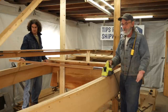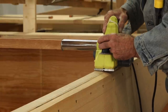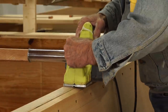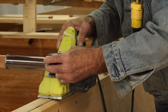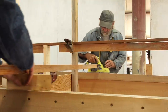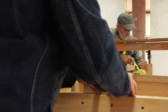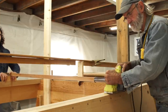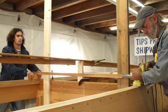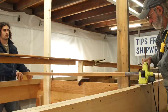I used to do all this by hand and it was wonderful, I enjoyed it, but we've got power now. So when you've got power, you use it. This really does make it easy and obviously much, much faster than if I was going to do it with hand planes. I could make a depth mistake if I had the plane set way too deep, but I can't make an angle mistake because it's being controlled from the other side of the boat. Caleb is working up and down with me as I slide forward and backwards, so it's always at the proper angle. I can take all the meat I want right down until very close, then wait on that last tiny bit until I get the side frames on and touch it up with a hand plane.